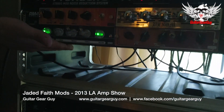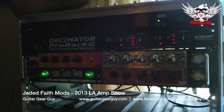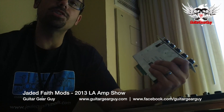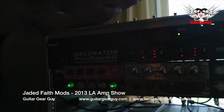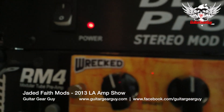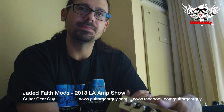For a very small amount of money versus owning several expensive heads, you can have an army of amps all in one for much less. The plug-in card handles the preamp and can be paired with any power amp of your choosing. Right here we have a four-space rack mount preamp going into a power amp. There are also combos and heads in 20-watt, 50-watt, and 100-watt varieties. Everything is all-tube on the back end. It's fully serviceable by the user — you can use any octal-based power tube of your choice, takes about three minutes to swap and bias. Very DIY-friendly and budget conscious.